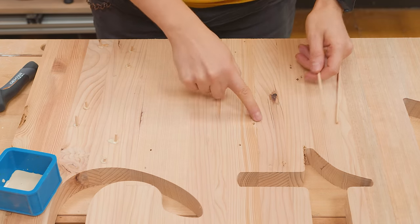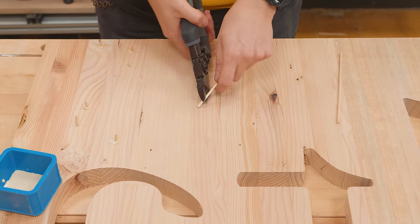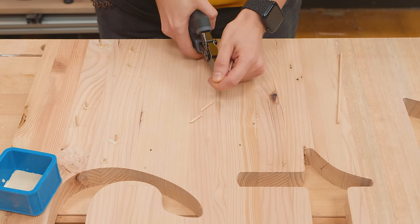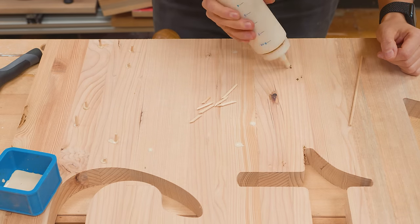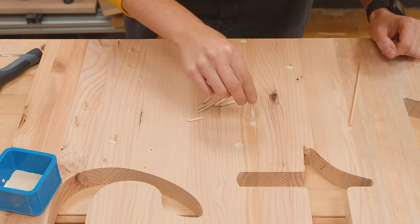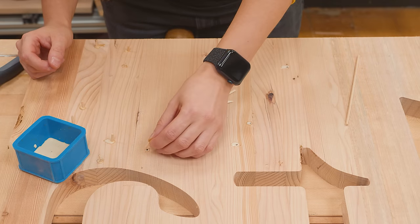The underside of the middle panel had lots of holes from large pallet nails, and although these won't be seen in the final project, this is for a client. I didn't feel comfortable delivering it the way it was. So I decided to fill those with thin dowels. For other imperfections, I used CA glue to make the surface smooth.